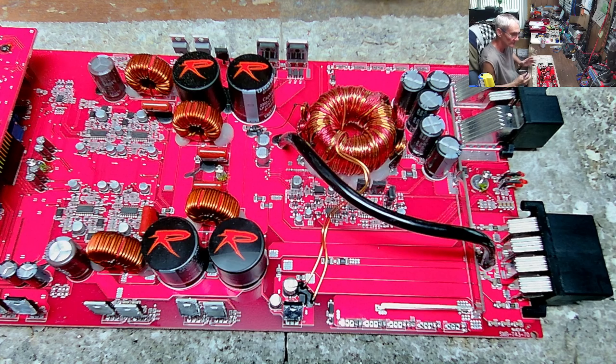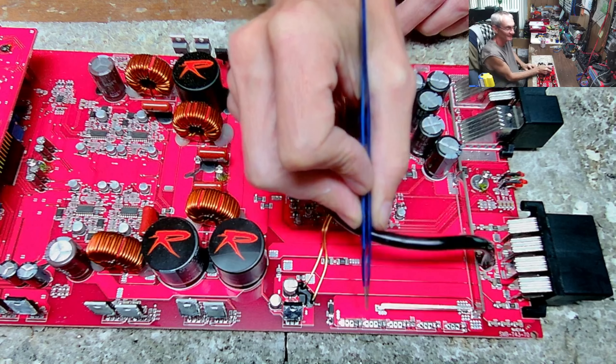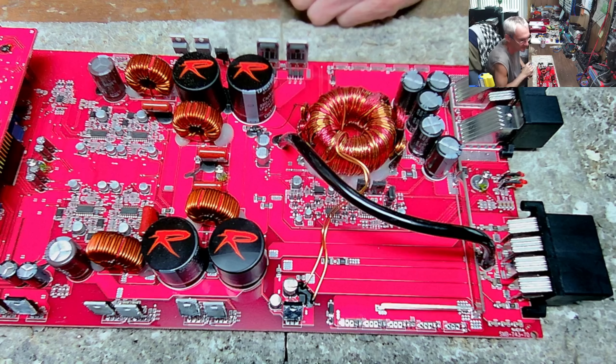Pull the boards, guys. These are easy to fix, so pay attention to things that can go wrong. Up top there is no drain trace — the trace is on the bottom side of the board, and the drain is what gets popped open on a severe power supply fault. Check your drains. If you have a parallel bank of transistors and one or two are heating up oddly in that bank, check the drain — especially if those transistors are matched. There should never be oddball heating; if there is, something is not being driven right within that transistor.